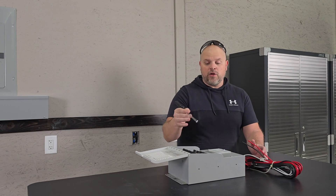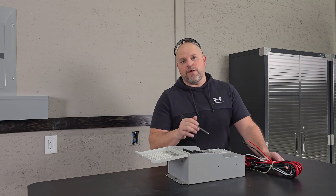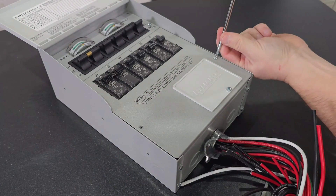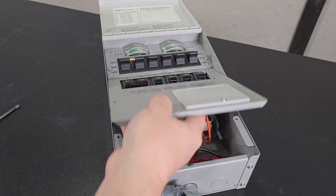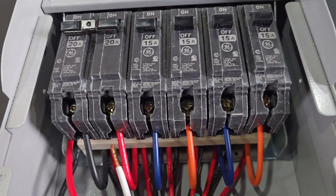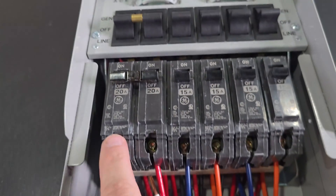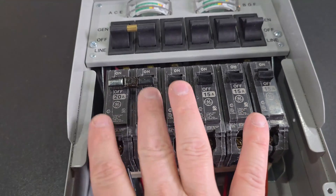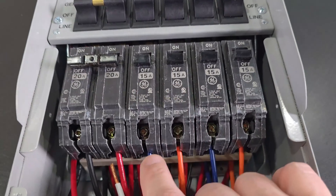This is a step you may not have to do — I have to change out a couple of these 15 amp breakers, so I need to take the cover off the transfer switch to put those 20 amp breakers in. Inside, you'll see where the connections are made to each breaker. I'll remove this bridge and this bridge to create independent breakers, so we'll have two 20 amp breakers rather than one single 20 amp breaker.